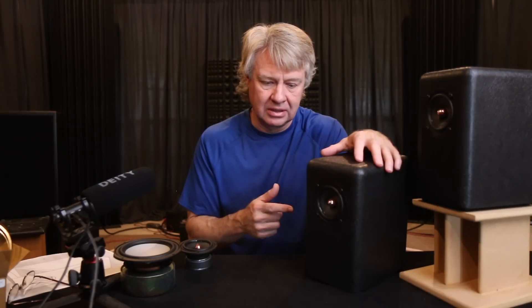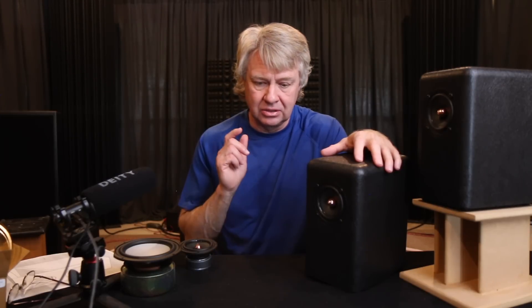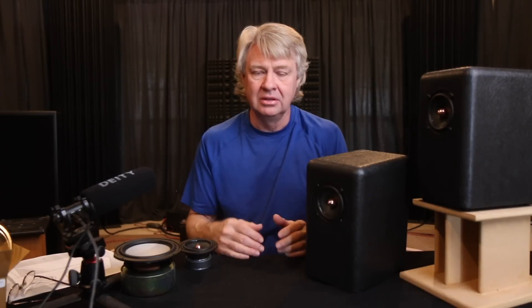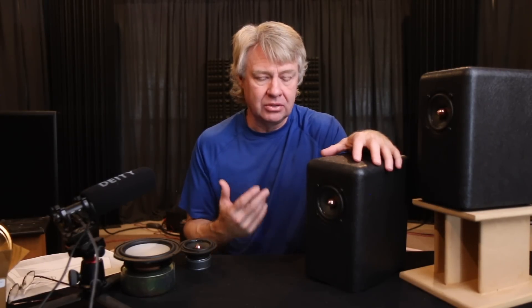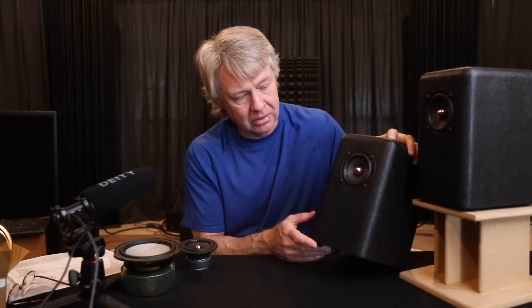If you're going to run these things at any kind of power levels, you have to put something in line with your amplifier or set your settings in some way to roll the bottom end off. If you roll the bass off, the more power they can handle. It's just like a tweeter — if you take a tweeter and you try to play it full range, it's going to reach its excursion limits immediately and you can't run a tweeter full range. It'll self-destruct. These are kind of the same way.